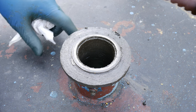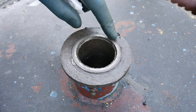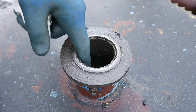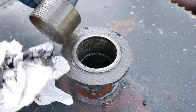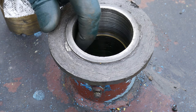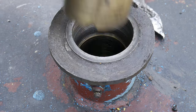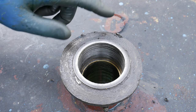This is the center of the main drive sprocket. It seems like there needs to be some sort of bearing surface in here. There's definitely something in here — there it is. This is split in two pieces because there was a grease fitting in the middle of it, but boy is this all rough. That should be somewhat of a press fit there. This is really a scored up mess in here. I'm going to have to do some thinking about how I want to handle this.